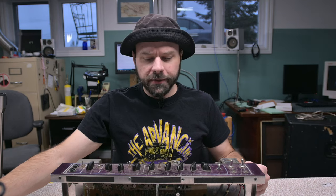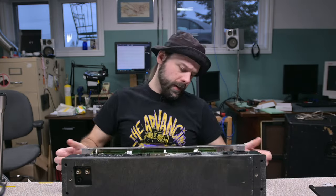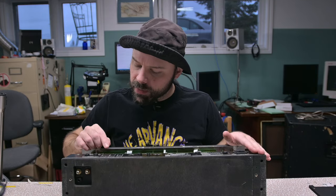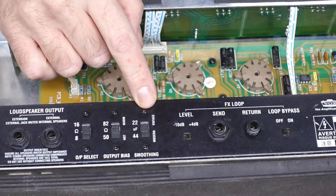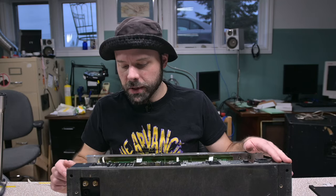The reverb being turned out of the circuit isn't going to cause some of the problems we're dealing with here. It looks like we could situate it like this — reverb stuff connects there. We're not going to be reconnecting the reverb. We'll set it to 8 ohms. Output bias, smoothing, modern/vintage — there are some features I'm not that familiar with. Now what we want to do to start things off is some sanity checks.